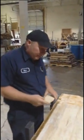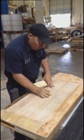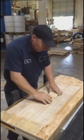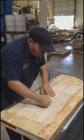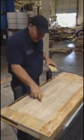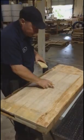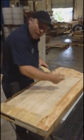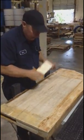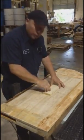One thing you'll want to do if you have any major holes in your kickback is you want to patch those with your stock maple. So if you had a hole this big, you'd want to make your stock maple a little bit bigger than your hole. You'll put it over the hole, trace around the stock, because this is only 1x under here too. So now you'll take your skill saw and you'll saw on the lines, and then take your pry bar and pop that piece of 1x out of there that's damaged. Then you can place your new piece of 1x stock into that hole, use liquid nail and drywall screws and countersink them and screw in your new piece of wood.